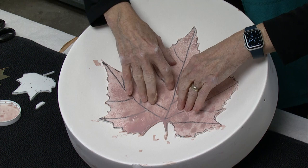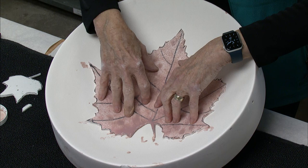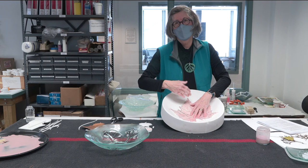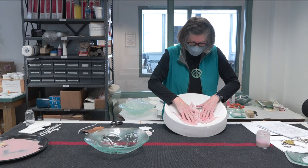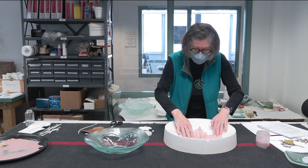With the kiln wash, I can usually get a couple firings out of this process, but if you want to make this more permanent, you can actually rigidize the 1/8-inch fiber paper with a silica-based or alumina-based liquid and fire it. Of course, it's hard to clean the mold when you're done. You really have to use a green scrubby and get all the residual material off. But it works really well if you want to make 10 of the same thing, to rigidize or stiffen this.